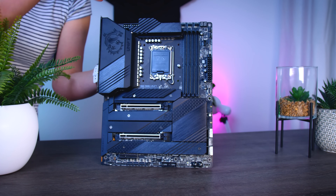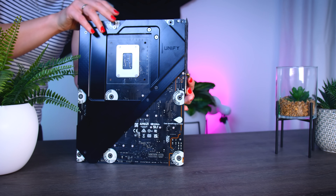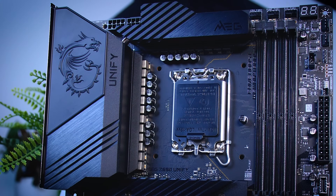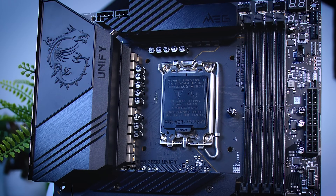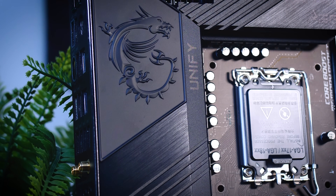The Unify includes physical buttons and is nicely reinforced with a lot of metal on the front and back — which matters most if you're constantly swapping hardware. The VRMs are upgraded to 19+2 phases with 105A power stages, plus voltage readout points. This board is basically in line with the Aorus Master, which is a little cheaper, and the ROG Hero from ASUS, which costs considerably more. Choosing between the three will likely come down to brand preference or looks, as MSI takes a unique approach by dropping all the RGB, which many will appreciate but isn't for everyone.